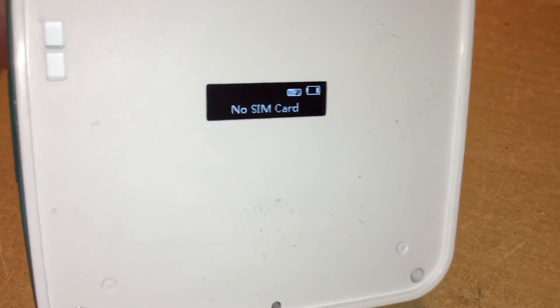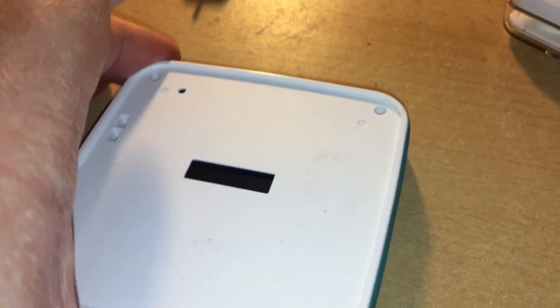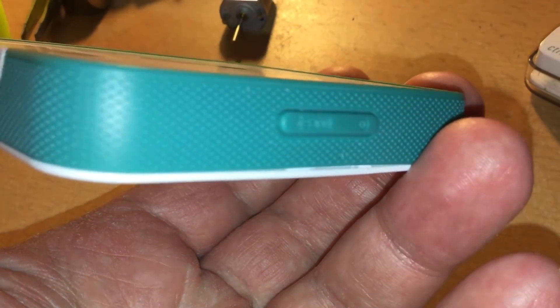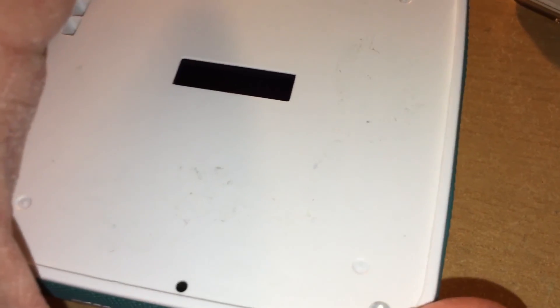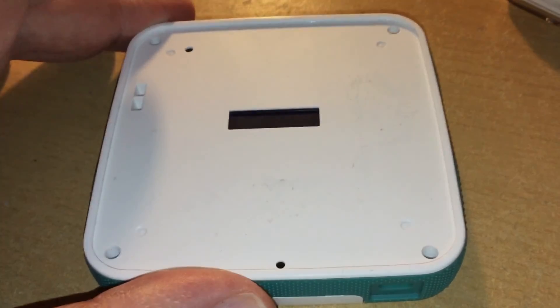Just something to watch out for when you remove the ribbon cable connector for the OLED display: do not lift the latch up — the black latch that says OMRON. Pull the cable horizontally out from the socket, and likewise push it back in again after you've finished, and stick the Kapton tape down. This latch on mine came detached and it took half an hour to re-fix it. And there we have the reassembled Y855, AKA EE Osprey mobile broadband router. Once that assembly is back together again, just push it back together and it clicks back together like that. Do not make the mistake of lifting the latch on the ribbon cable connector for the OLED — the latch broke off on mine. So thanks for watching, bye bye.